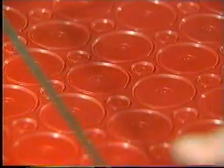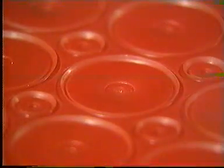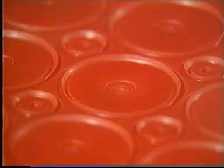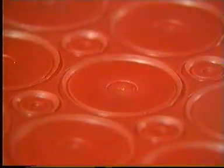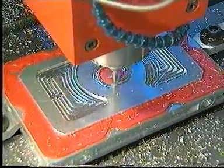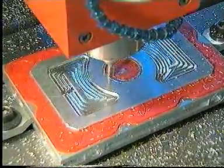To demonstrate the action of the lipped edge suckers, a plate of glass is placed over the Vacmat. When the vacuum is applied, the lips deflect outwardly, pulling down the component, or in this case a plate of glass. When the vacuum supply is removed, the lips reform. The Vacmat's unique design enables components to be machined through without losing vacuum hold down. No other system offers this.